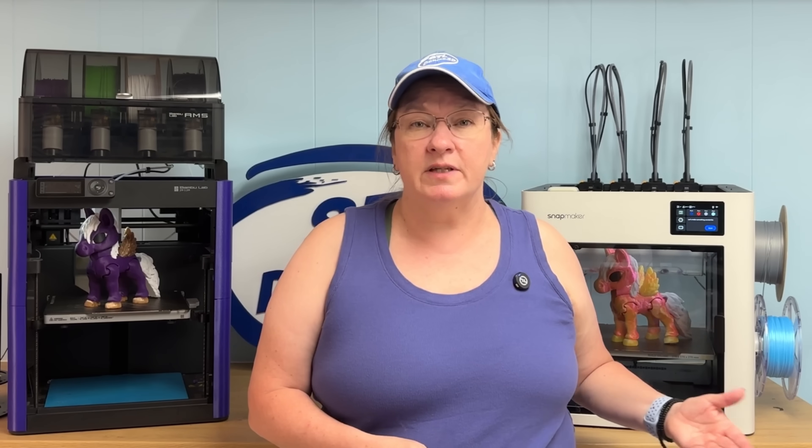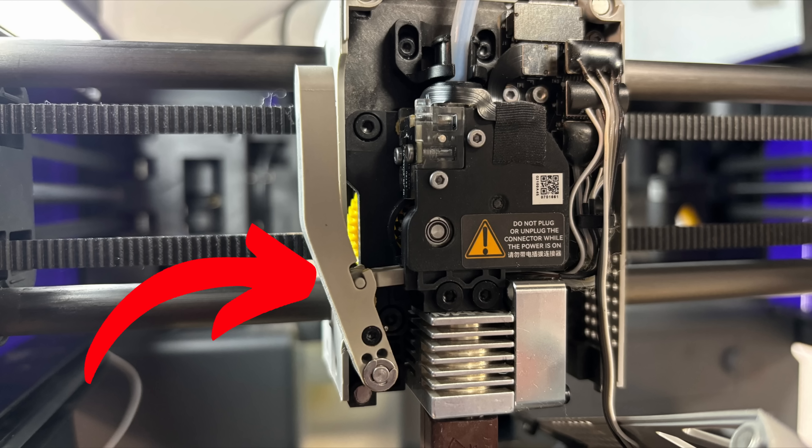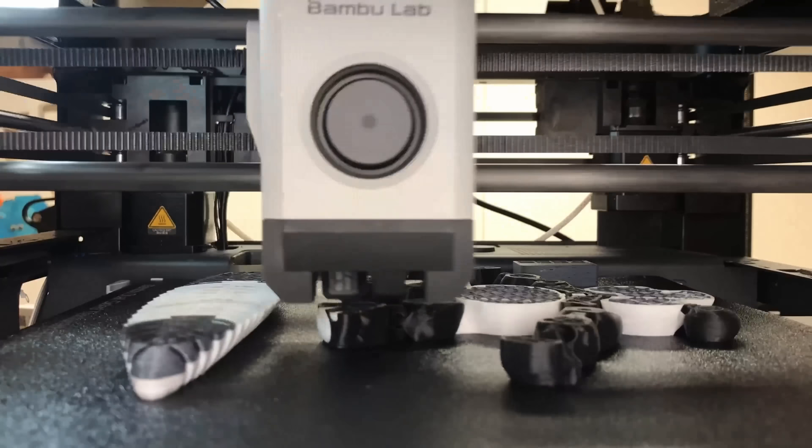On a traditional multi-color 3D printer, like the Bambu with its AMS or Prusa's MMU, all of the spools share one hot end and one nozzle. That means every time you change the color, the nozzle needs to be cleaned out. The big problem is it's hard to pull out every little speck of hot plastic. Bambu solves this by using a knife that cuts the cool filament off so it can be retracted out of the way. The new filament comes in and pushes the old color out in the form of printer poop. The slicer lets you tweak this flush amount, and you can avoid waste by putting that transitional color into the infill or a purge object, but a lot of it just shoots out the back as waste.